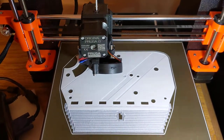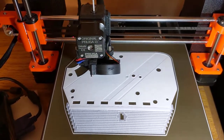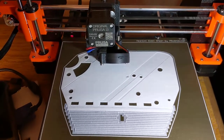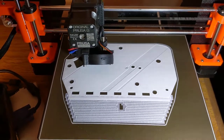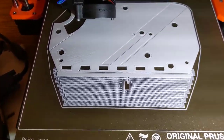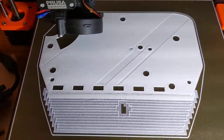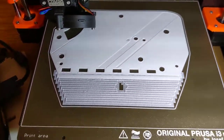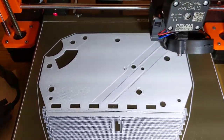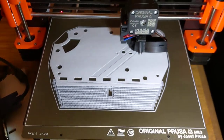Instead of knocking it back just 0.05 to 0.95 instead of 1, I went to 0.9 because I was having such big blobs fairly frequently, and I figured I'd just go 0.9 and see what happened. I've still got a little tiny bit of blobbing — just a tiny bit in the support material and some of the square holes. I cut them off with flush cutters, pushed it down as it went through the next layer, and mashed it down so it didn't stick up. And it seems to have, fingers crossed, allowed it to keep printing without any major issues.